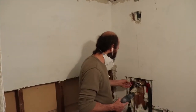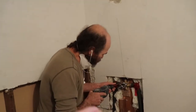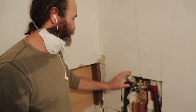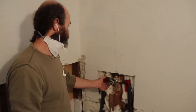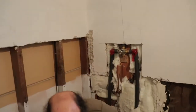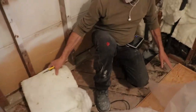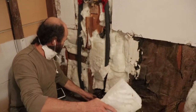This is an exterior wall, so I just want to put some extra insulation in here. We have another video on how to install the faucet for the shower — we'll link it to this one and include all the connections for the faucet. This is R14 insulation because the wall here is just a 2x4 wall — old walls. Here in Vancouver the new code is a little bit different, but this one is the old standard.